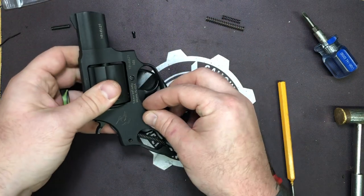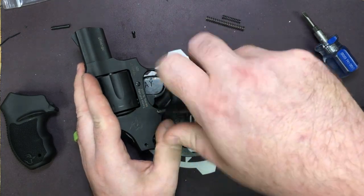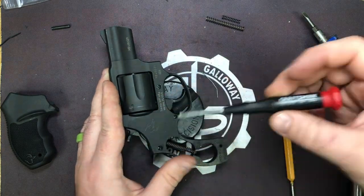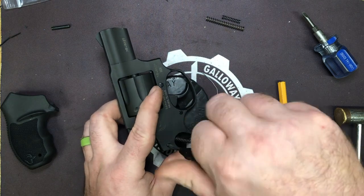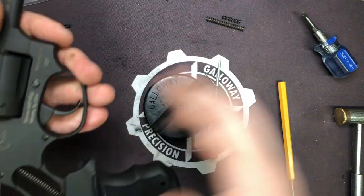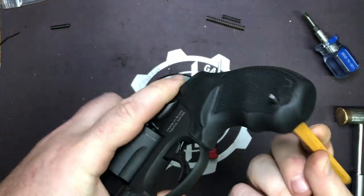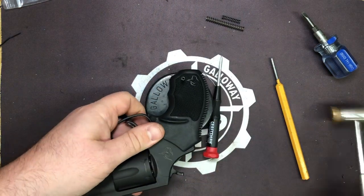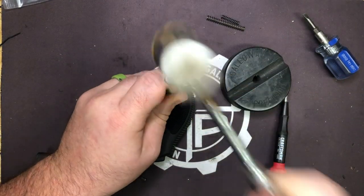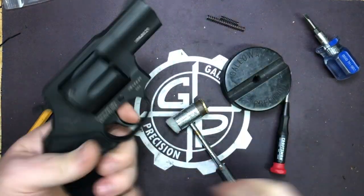So we've got our front screw in. Remember, we want the cut down, ball forward, and triangle down — if you go the other way, it's not going to seat correctly. You can actually blind-do this whole part with the side plate on, and that's it — it's in place. Make sure your seat is all the way in and down. Go ahead and pull the trigger just a couple of times, make sure the wheel revolves. The revolver is actually revolving — hammer's moving, and when the hammer strikes the transfer bar, the firing pin is poking it. So we can go ahead and put our last two screws back. Generally your rounder screw goes up front and the flatter screw goes at the back. We've got both our screws in. Go ahead and put your grip back on, make sure the holes are lined up, take your one-eighth punch and ensure everything's lined up, making sure we are equidistant on both sides. That's it, you're ready to go.